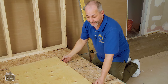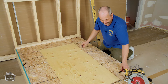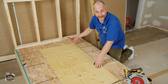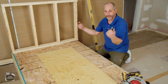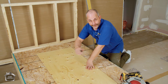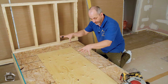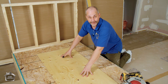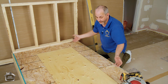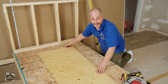You don't have to buy a whole 4x8 foot sheet - just buy enough to get your access. Lay it down, trace it out, and cut that line. When you're done you'll need to chisel off the glue and the remnants of the other OSB, then you have the right size piece to go back in. Don't try to measure out a 2x4 foot piece - just buy it first, set it down, and trace it. It'll save you a ton of time.